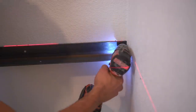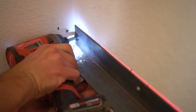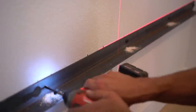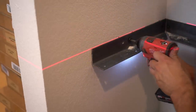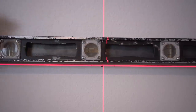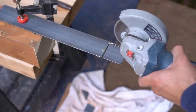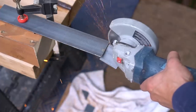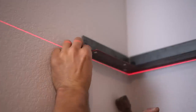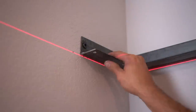I'm not countersinking the side attaching to the wall because I want as much meat on this as possible — a larger screw with a somewhat flat head is all we need for that application. Once I fasten both sides of our bracket, I know it's perfectly level because of the laser level and I secure the remaining fasteners, including the side brackets cut exactly like the back bracket. For the shelf bracket system, rather than a mitered technique, I cut a small square out of one corner on each side so it fits snugly into place. Both side brackets for the shelf are fastened down, and that's all we need for our bracket systems.